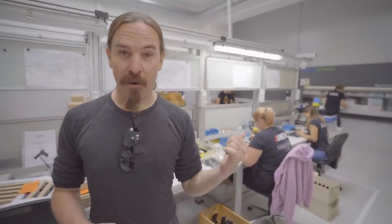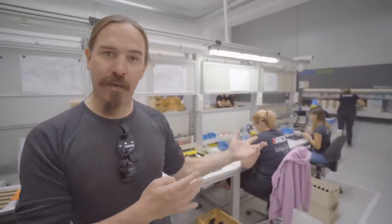Once all the parts are finally done — going through all of their QC, finishing and polishing — they come here for assembly into complete guns. That's all a hand-done process, and half of the assembly crew is at lunch right now. They then go to RX's own small range where they get two proof rounds each for internal quality control, and a number of rounds for function checking, just to make sure everything is running right. For sales within Europe the guns have to be CIP proofed — they're not licensed to do that in-house — so after their own in-house proofing, the guns go to Austria or Hungary for actual CIP proofing, and then it's packaging and shipping out to distributors and retailers.